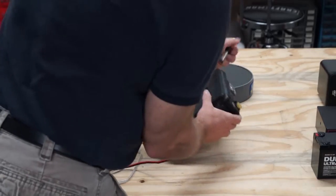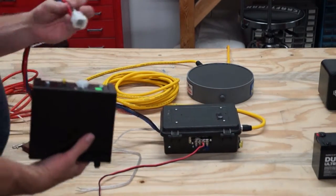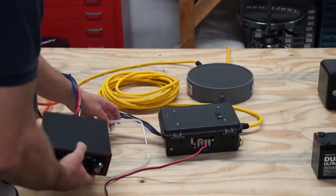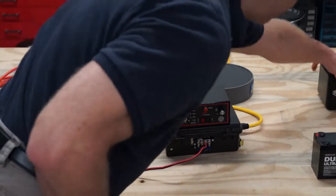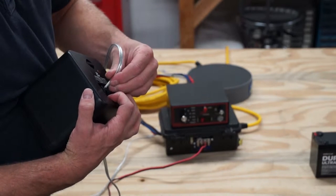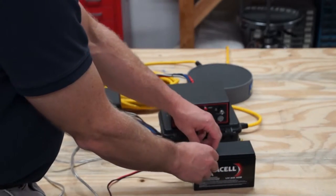You can plug the underwater speaker into the side of the control box. The amplifier is plugged to the snake — it's key indexed, a nine-pin key, so you can't connect it wrong. There's a 20-amp fuse there. Put the amplifier on top. Take your air speaker and place it into the terminals in the back.